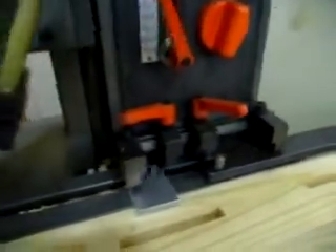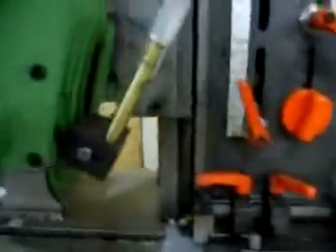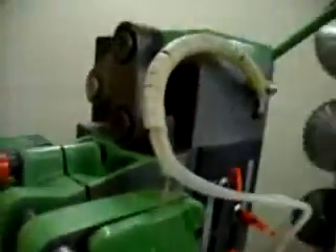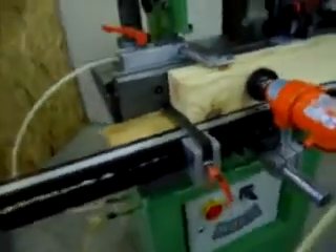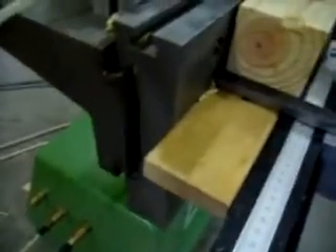Around here you will see this is the double fenced stop from side to side, so you can set that up. You can also do a second stop and you've got the sliding table set within those two stops, so it's all very fast, very efficient, very nice. These are the blowout jets — simple on or off. This is the feed unit, which is a nice heavy unit. Everything on here is really well built, solidly made. It's all got grease nipples on it so you can keep everything oiled and greased up nicely. The air hose setups down there are for the blowout jets, clamps, and a spare air hose if you want to clean out the table. This is one of the cutters — on the front here you can see you can adjust the throw on these cutters.